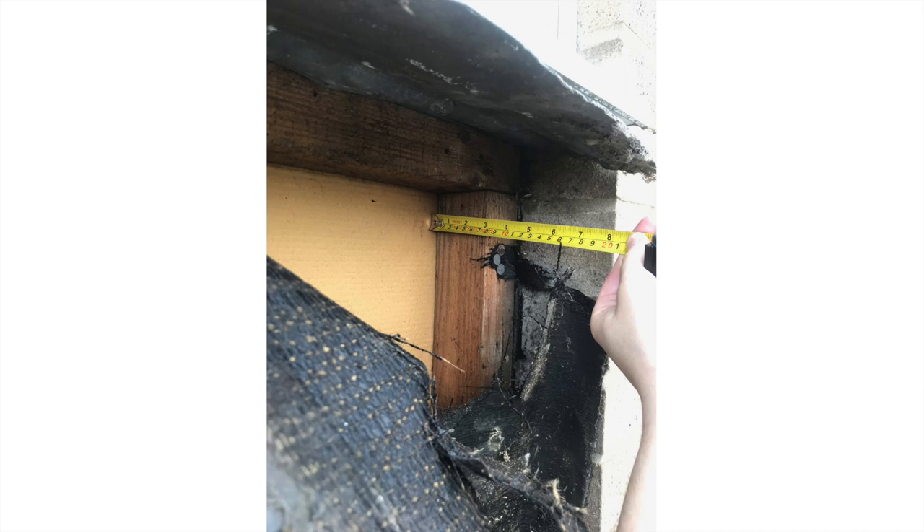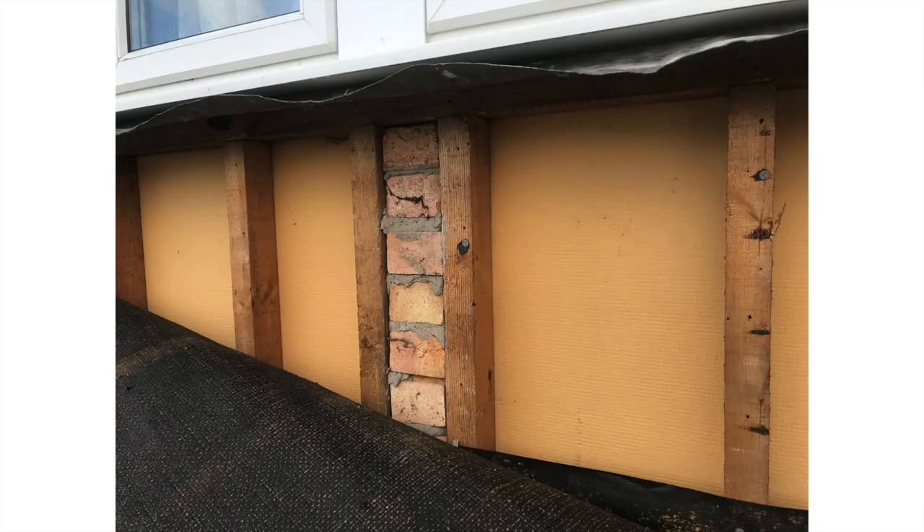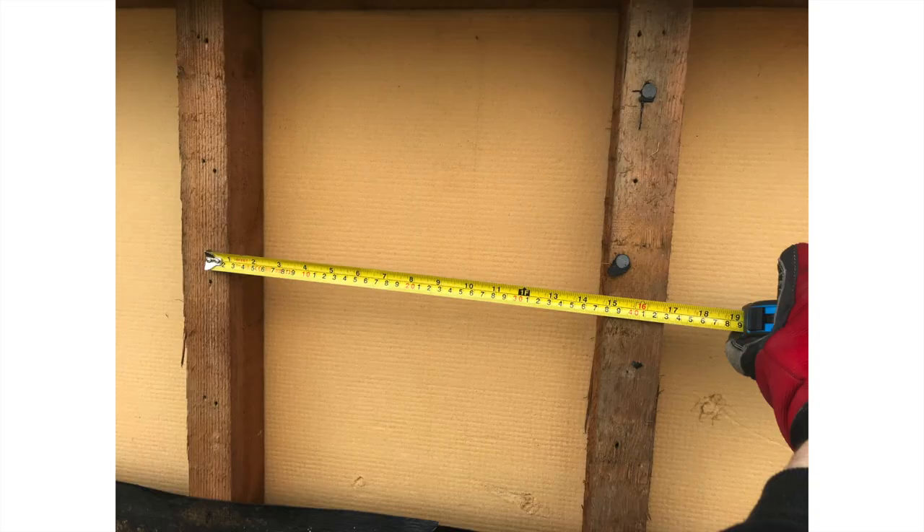You can see that's about seven centimeters in there — the wood is about seven centimeters deep. Just take the felt off. They're 16 inches from center to center, about 40 centimeters from center to center.